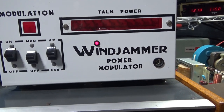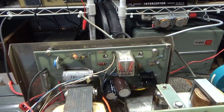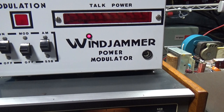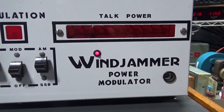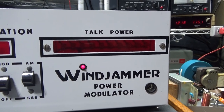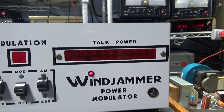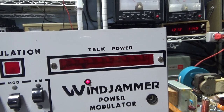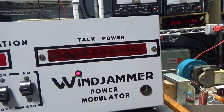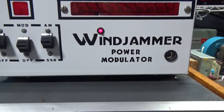I have a power modulator similar to this one but it doesn't have the LED readout — it's just called a pot power modulator. I think the same people who made the Firebird 500 made these. Anyway, it's just a single 6BQ5. On Facebook there are some hams talking about why do they call them modulators — they're linear amplifiers. I'm like, no, they're not designed to be linear. They're not designed to do five watts out for every watt in. They're designed to be nonlinear, where they dead key low and swing high.